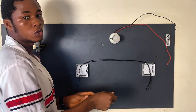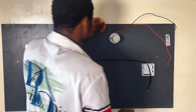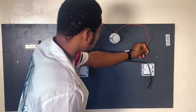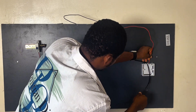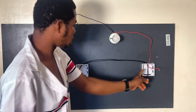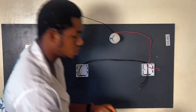You can see these two wires are going to connect L1 and L2 of this switch to L1 and L2 of this second switch. Now this is the red wire from above — this red wire is going to connect to the common terminal of this switch. Remember, this red wire from above will connect to the common terminal of this first switch.